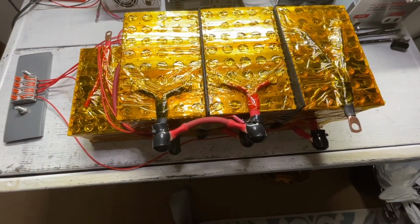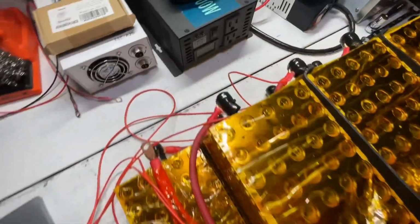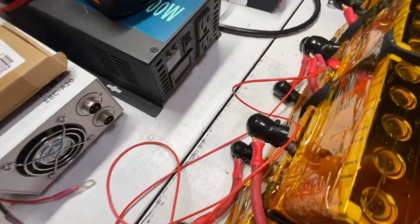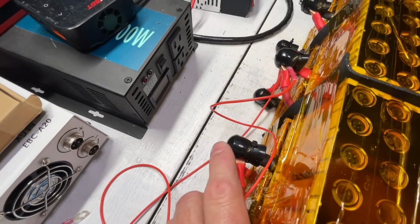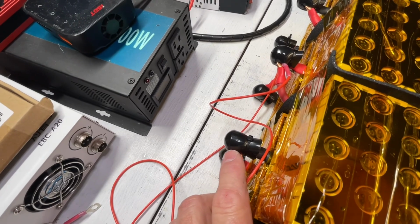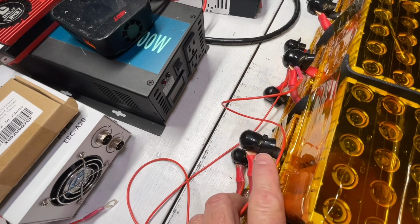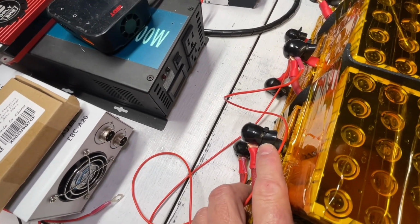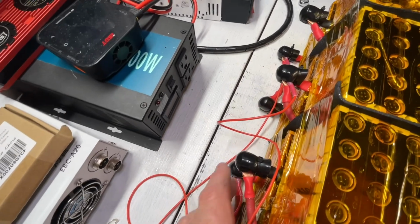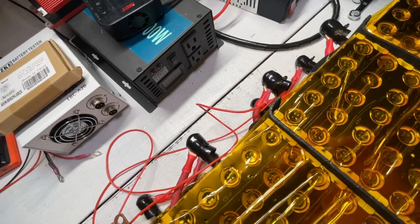Okay then guys, we've now completed our battery. As you can see, I went ahead and connected these rubber stoppers on the end of all of the terminals with a cable tie. I actually get these from Menards, as I said. I think they're 3/4 inch rubber stoppers. I split them on one side, heat them up with a heat gun, they slide straight on, and then put a cable tie to hold them on. Just helps with a little bit more insulation. And previously added the rubber matting in the middle to make sure we don't short.